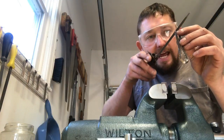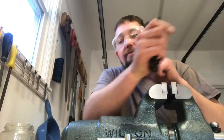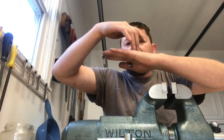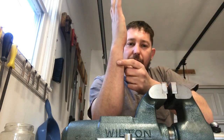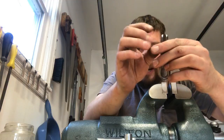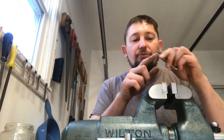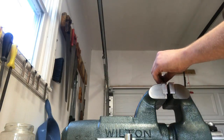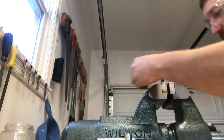I'm going to just cut like a little V notch in, a little relief for my knee bend, because I noticed that reeds flex the most irregularly at the knee bend, because that's where the most flexing is. Back here in the deck area where it makes most of the sound, that's not where the irregular flexing occurs. It's right here at the knee bend. So where the frame comes around it, I like to make a little relief cut. If you get violent playing a harp, it has a little bit more leeway, because it really doesn't create much sound out there. So I figure it's a very small sacrifice to make for a harp that can be played a lot more aggressively. And you don't lose much back pressure at all.